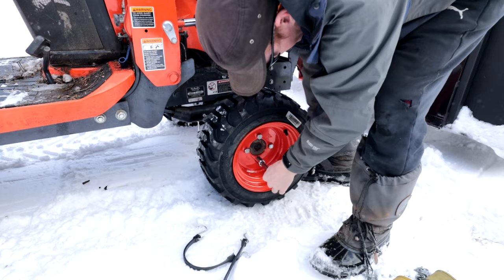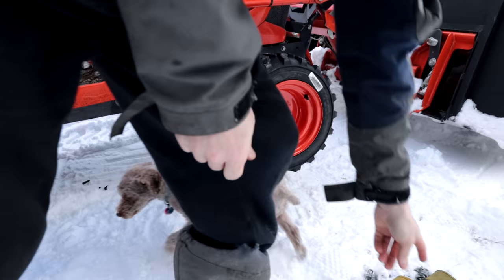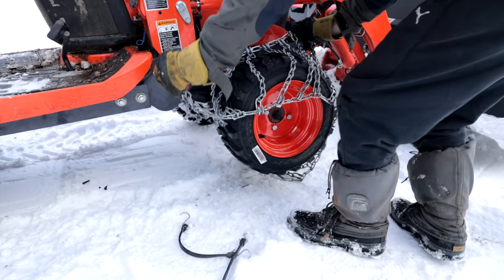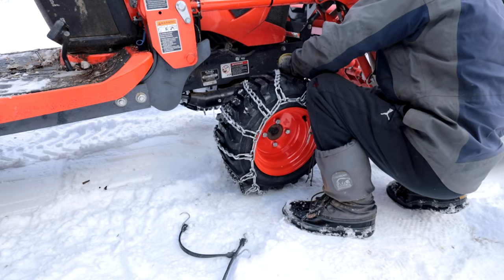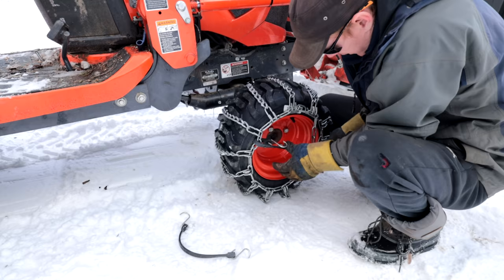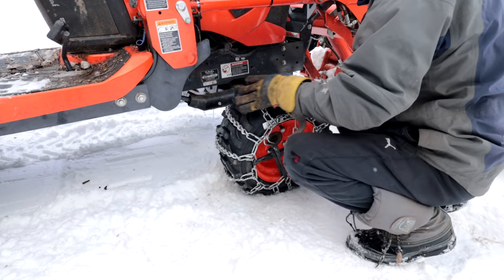That's the kind of dealer I got. I've got a spare set of tires now. I was talking about foam filling, so they're going to assess whether or not the tires that I have are worthy of the foam filling, because I know that the foam filling is not cheap. Although that's sort of a permanent solution to finding sharp sticks in the bush and nails and whatnot, because once it's foam filled, they're basically puncture resistant. I know there's problems with those wide tires with the low profiles. In an ideal world, if you're not pushing it and you're just mowing the grass, chances are your tire's fine. It's when you're doing extracurricular activities and you've got it in the bush that a foam-filled tire is ideal. So we're going to see that, and maybe we're going to change the two front tires out. Foam-filled. Set it and forget it.